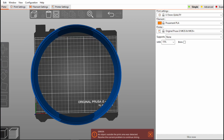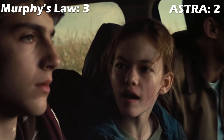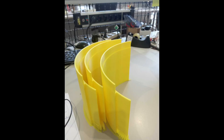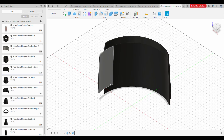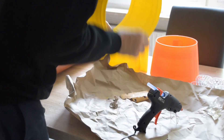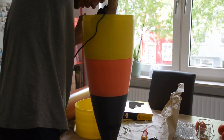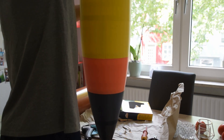Unfortunately, it turns out that our 3D printing machines were not quite wide enough to accommodate the full diameter of the bottom section rings. Murphy's Law. So once again we had to improvise around the limitations of our tools. To solve this, we kind of had to design like a Lego nose cone — basically printing out the sections not in full circles but in sections of circles. These could all fit on the 200mm by 200mm printer that we were using. It was a lot of printing — some days of printing — but finally after about a week we were able to get all the sections ready to be stacked. The way this works is we have these overlapping slabs which can be glued together, three of them to make a ring. The rings have grooves around the top which slot into the next ring, and you can stack the entire nose cone, glue it all together, and you have your mandrel.